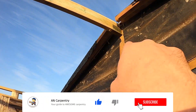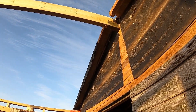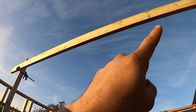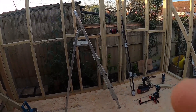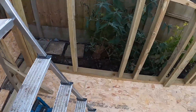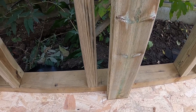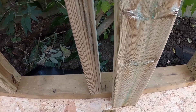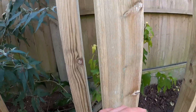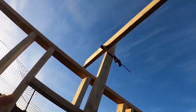I've notched it sort of halfway onto the old one. What I need to do now is find the middle center of the plate. I've marked out the center, and with the center you need to mark out where the thickness of your ridge is — in my case it's going to be six by two, so that's 22 and a half millimeters on the side. I've clamped or screwed timber upwards level.